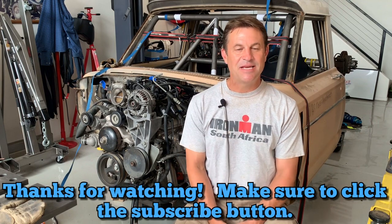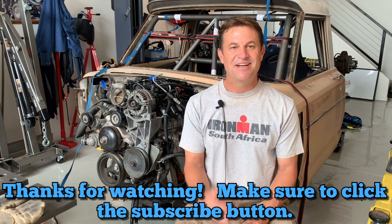It only took a couple of tries to get the B-pillar right. I went through some metal, and that's okay — it's such a critical part, you need to get it right. By the time I was done I was hitting my bend angles within a fraction of a degree and dimensions within about a sixteenth of an inch, which I think is pretty good. Every time you're off, it makes weld gaps, and any time you've got a weld gap you're compromising strength and pulling the metal around. I hope you learned something in this part one of two of using the BendTech software. See you in the next episode — please hit the like and subscribe button.